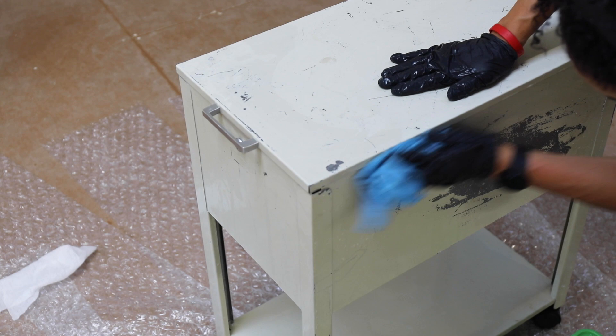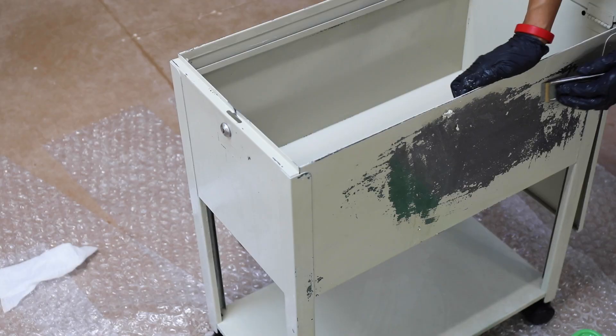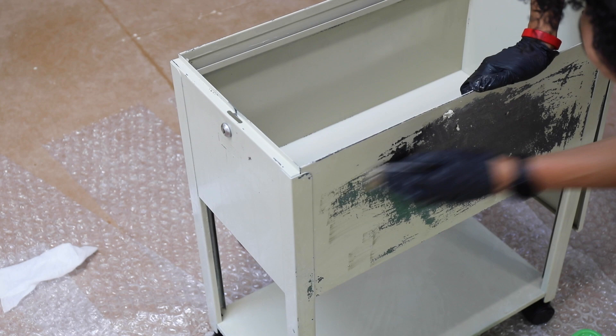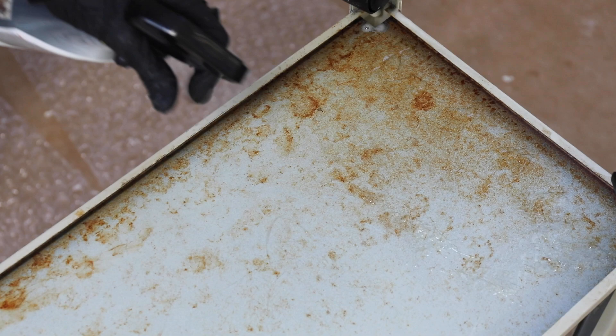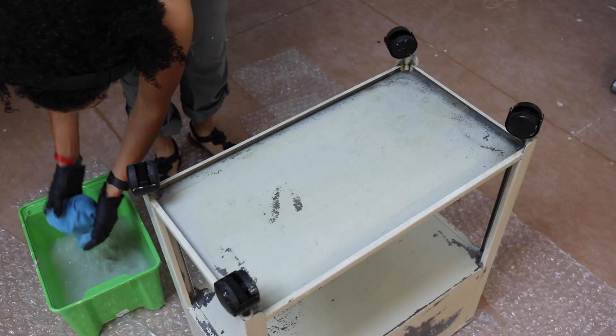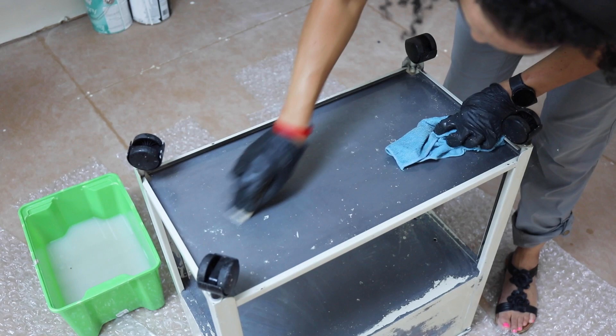This is what happened when I started removing some of the rust remover that did dry a little bit — the finish started coming off, and I was worried it would create a bumpy surface. To minimize the damage, I used the scraper to remove any loose bits of finish and then continued on with the project. I love to finish the bottoms of pieces of furniture, because if somebody turns it over or you decide to sell it, you don't want them to see the ugly bottom you didn't finish. If you're using rust remover, do a test area first to see what it's going to do to your finish.